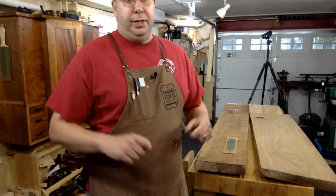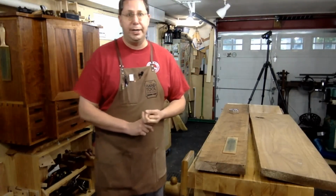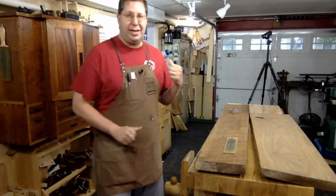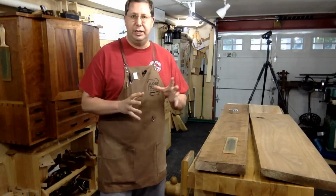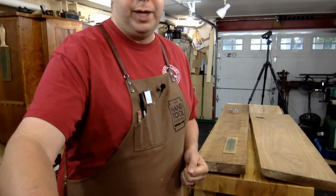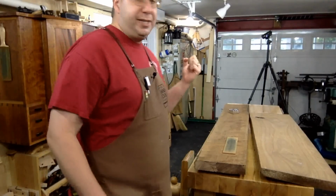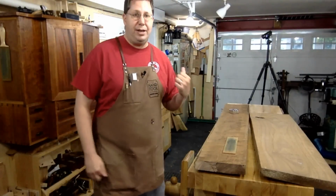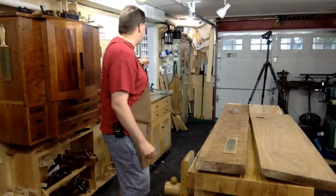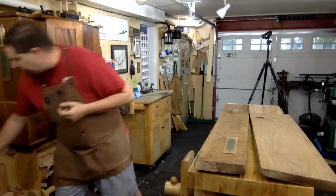But eBay, antique shops, you can still find them, just be prepared to put a lot of work into them because they tend to be really beat up. Even mine is a little bit iffy now. The gears are starting to slip on me a little. I'm not too happy about that. As far as the wheel that's on it, it's just a Norton 3X wheel. I have a 6-inch and an 8-inch. An 8-inch will actually fit on that wheel. I used the 8-inch for years. The 6-inch that I use now, I specifically grind a significant curve in it, and that's for sharpening.